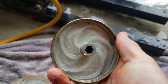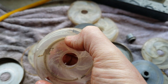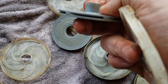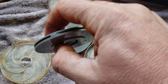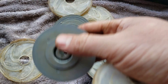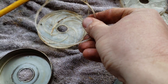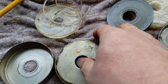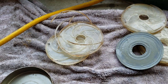Goodness, look inside this thing — pop this one for you. Get all that build-up; that's from it actually rubbing on that, you can see. I don't think that'll make any difference as far as performance. We'll check through here — you can also use an air compressor to blow these out, nice little tool. You just want to visually inspect them and then we'll put them back on. I like these pumps, I'm not distraught about this — this is just what happens. This is why they have the new impellers and diffusers now. With these all busting, no worries — we'll get them swapped out, she'll be good to go.